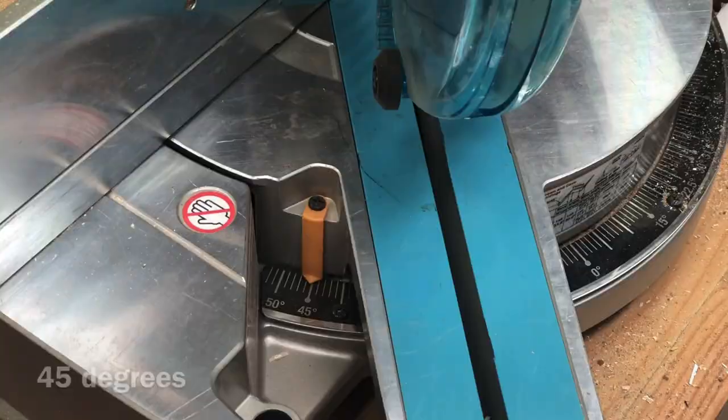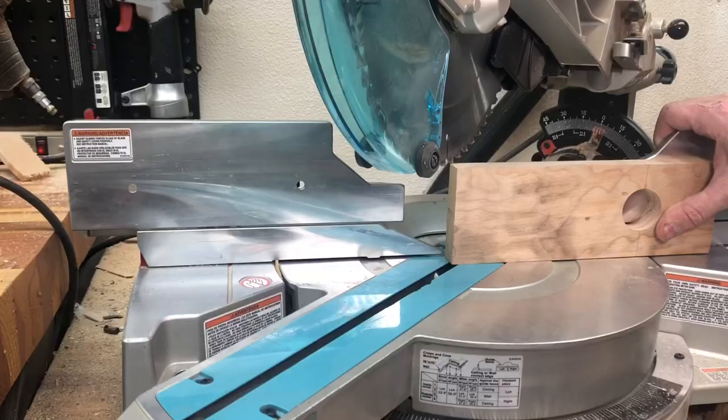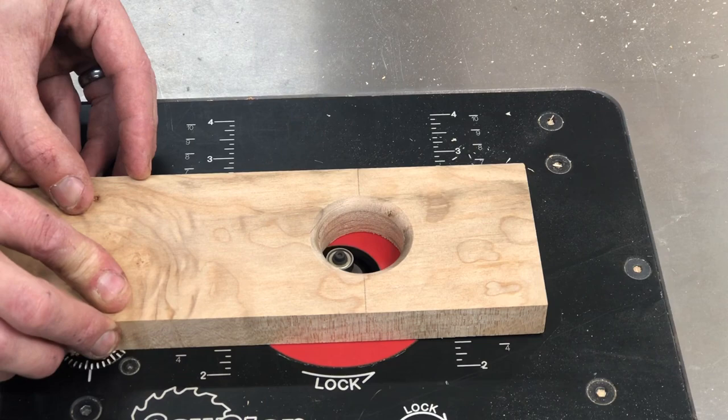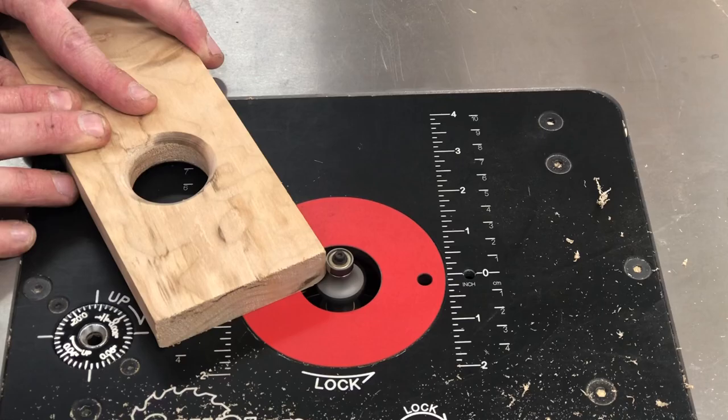What I found was the thickness of the wood didn't matter, the length of the wood didn't really matter. What mattered is that 45 degree angle and that 6 and 7 eighths inch distance from the bottom to the center of the hole. I should also say that the size of the hole did matter — this was an inch and a half hole that I made with a Forstner bit. You could use really any type of bit though, as long as it's an inch and a half. The rest of it was just for looks, and I used my half inch roundover bit to round over all the edges, make it a little bit more finished looking.